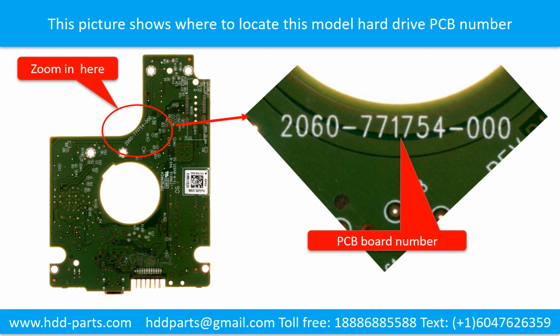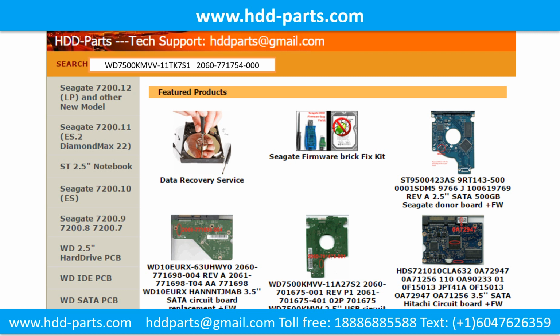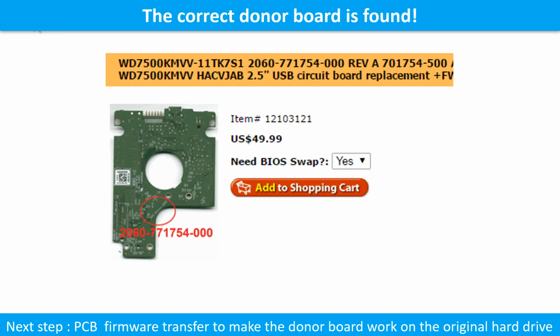You may go to hddparts.com to check out other brand name PCB board numbers. After finding out the hard drive model number and the hard drive PCB board number, we use them as a reference to search for the correct donor board. We found the correct donor PCB board for the hard drive, but this is only the first step. The next step is we have to do the PCB board firmware transfer to make the donor board work on the original hard drive.